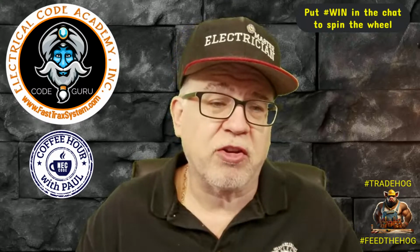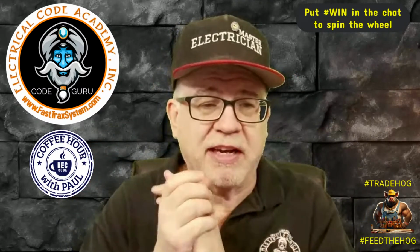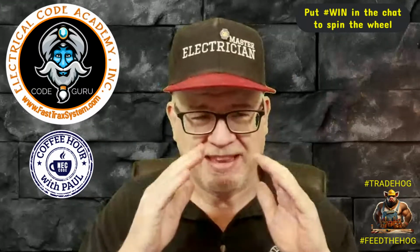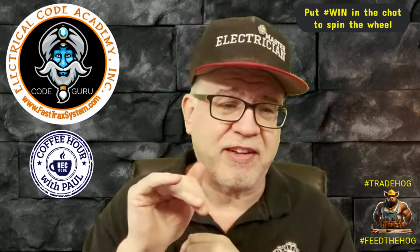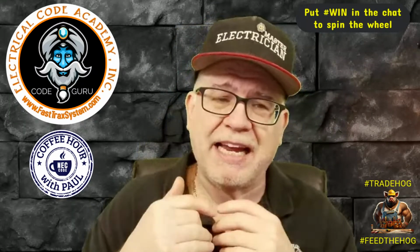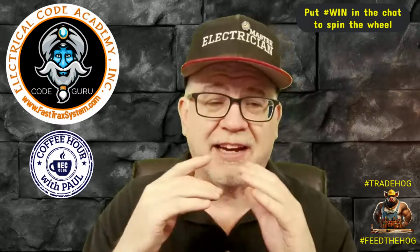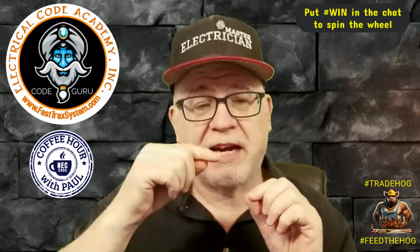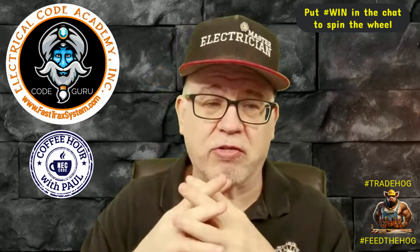And when it gets to the one where it talks about the cross-sectional area, I was talking yesterday to somebody who called me up and I was answering a question for them about the area. It's the area of the cable, not the conductors inside of the cable. It's the overall. That's why I gave you the formula for calculating the area. So basically, you treat the cable like a conductor, and you can get the diameter. Once you know the diameter, you can calculate out and find the area. And that's what it talks about when it says cross-sectional area, okay?